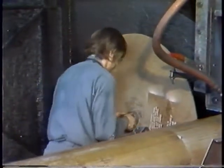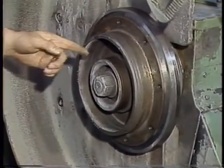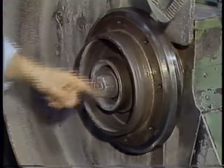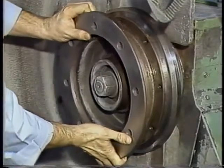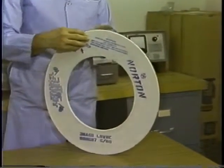The basic idea of safe wheel mounting is to carefully and correctly install a wheel on a machine spindle without damaging that wheel and ensuring safe operation. The process is somewhat long, but a simple one. First, a visual inspection is required by the ANSI safety code.